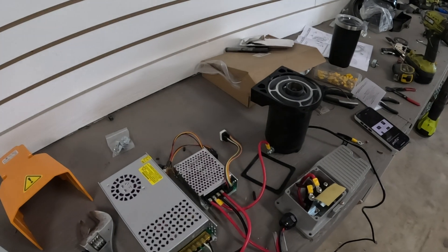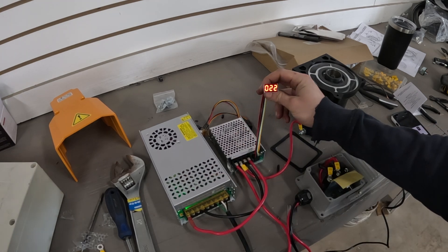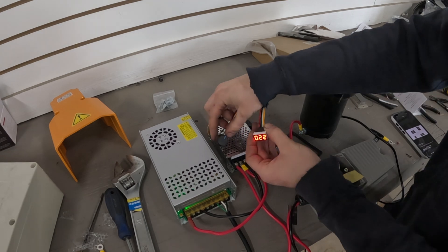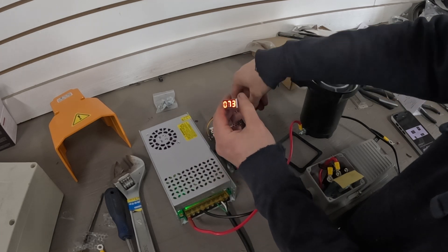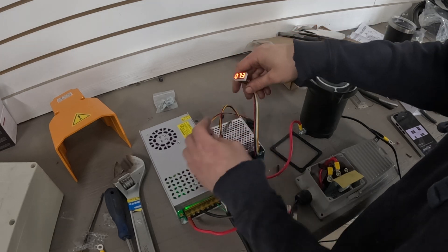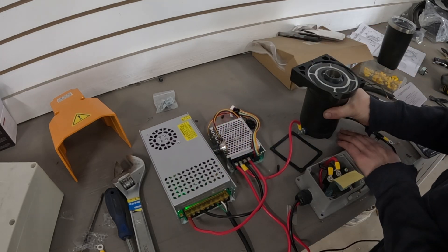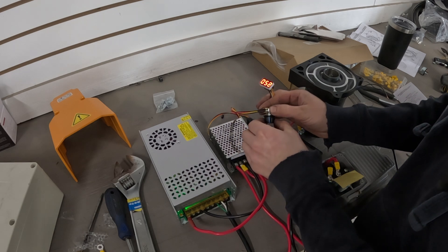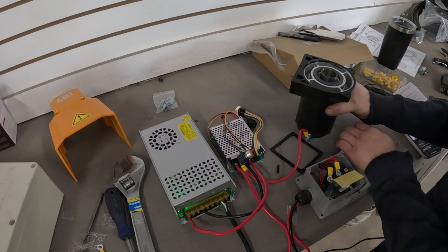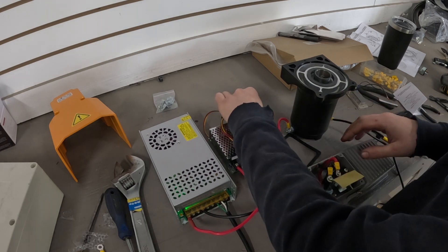Let's get this set up here. My inverter is on, I got power. This tells me my speed — if I turn my knob, yeah, 0% to 100%. And then this will switch my direction. Let's start at 15%. You can see the motor is spinning. Let's go 100% — oh yeah, she's got more power. Switch direction. Perfect, we got forward and reverse. The switch is all working.